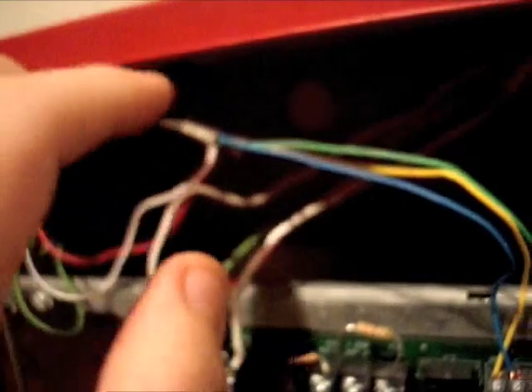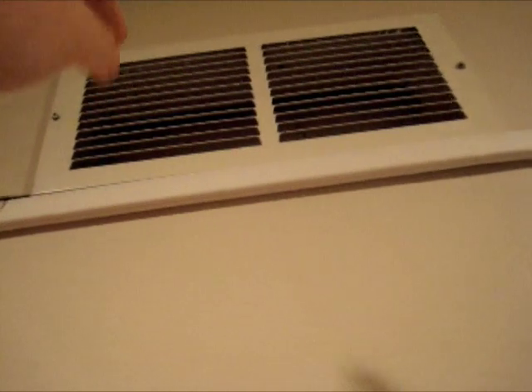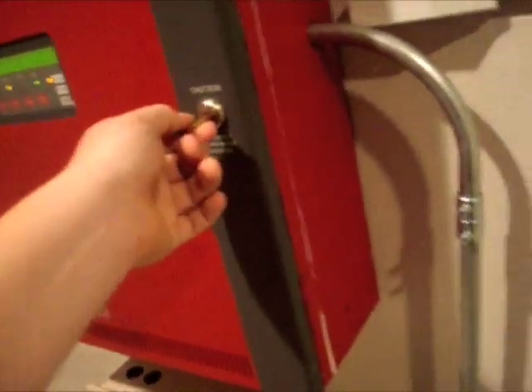So the real setup will have a two-conductor wire that will look like this. This is the wire to the annunciator, and it's five-conductor. I'll have a two-conductor wire like this — it'll go up through this wire mold, and then stop about right here. And then it'll go up through the attic and then to the electrical box in the smoke detector. So I'm going to need some really long wire for that.